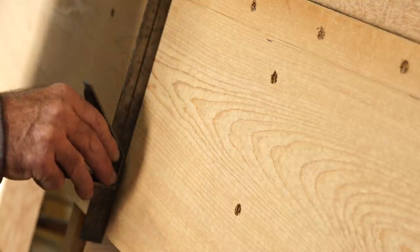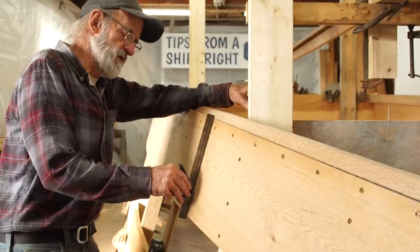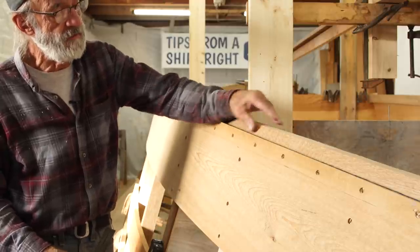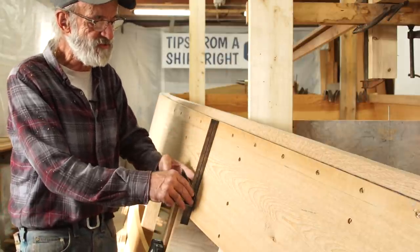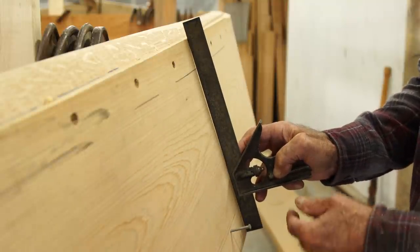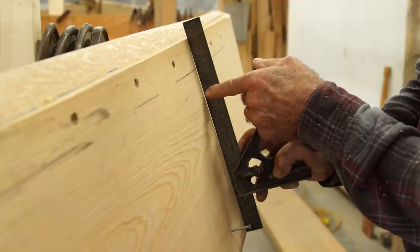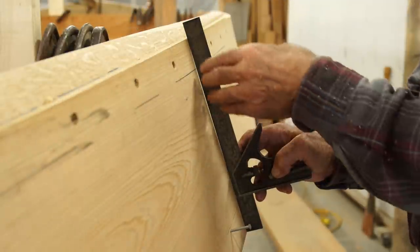I'm going to hold this straight edge up against the plank right there - you'll notice it just lands right on there really nice and perfectly. When I bent that plank around originally it had a lot of cupping in it, but once I've added the frames, the frames have taken the cupping out of it and also rolled the chine into position. This is what we're after - on the other side it would have a big space in it where the plank is cupped. Now on the starboard side you can see there's a little bit of cupping right up in here. The other side of the boat the whole plank was cupped all the way across and that straightened right out. When we put the frames in here we'll be able to roll that chine over a little tiny bit and get rid of most of that.